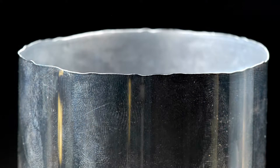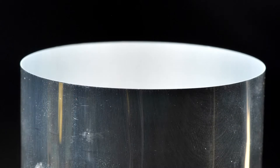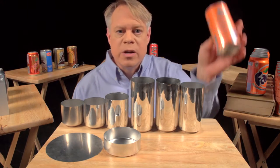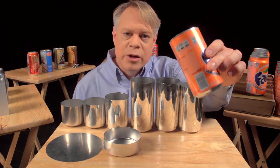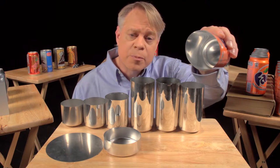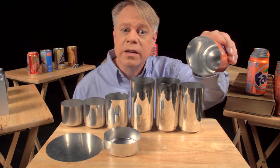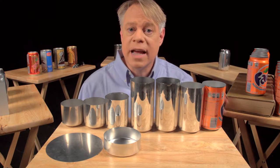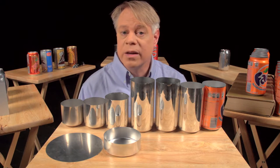If you look closely at the top of the can body, you see that the edges are wavy and uneven — irregularities that occur during forming. To get a nice even edge, about 6 millimeters is trimmed off the top. With an even top the can can now be sealed, but first a colorful design is printed on the outside — called decoration in the industry. The inside also gets a treatment: a spray-coated epoxy lacquer separates the can's contents from its aluminum walls, preventing a metallic taste and keeping acids from dissolving the aluminum.